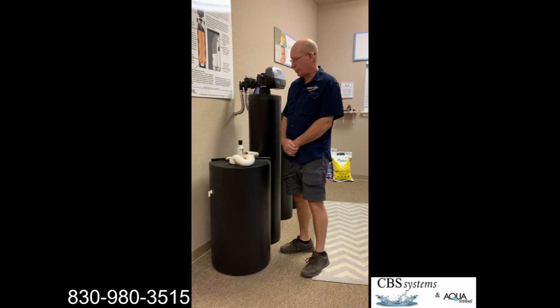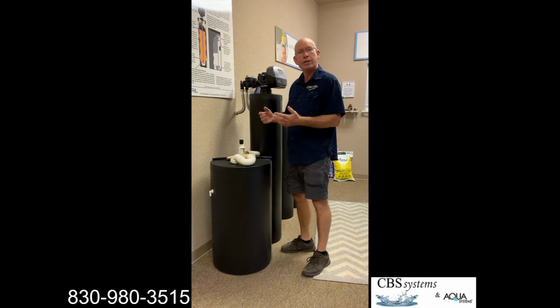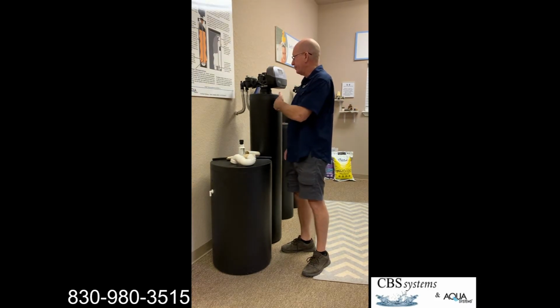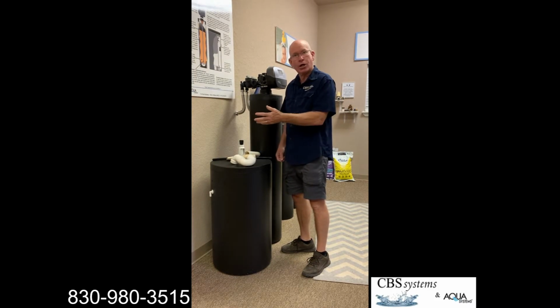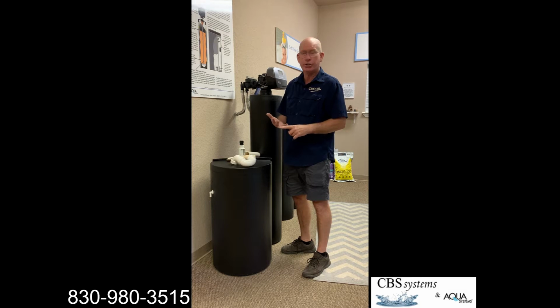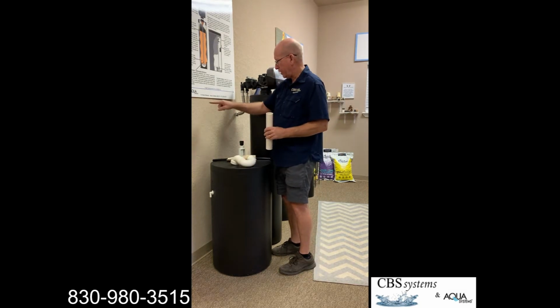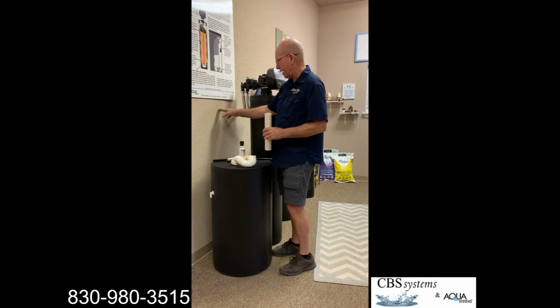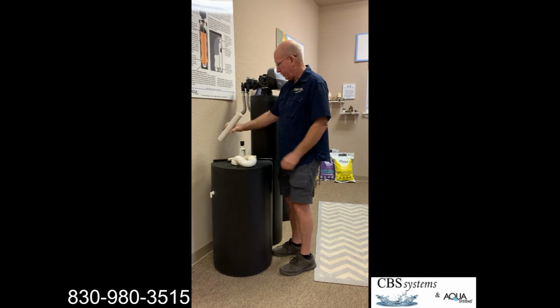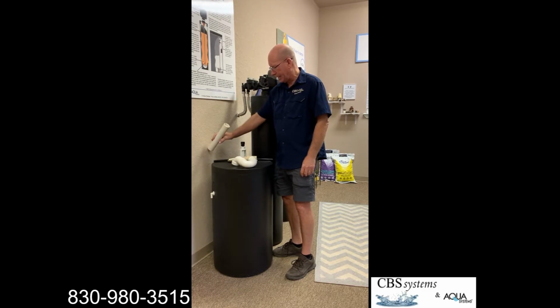Good morning. Today we're going to talk about water softeners and the drain, where the reject water or the regeneration water goes from a water softener. It has to be hooked up to a drain, whether it goes to the septic system or to the city sewer. Normally on a house there'll be a loop coming out from the wall made of copper or PEX, and then there'll be a drain line. It's either going to come straight out of the wall or it's going to be on an angle.